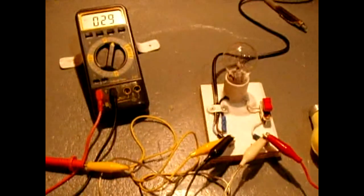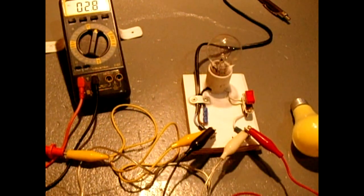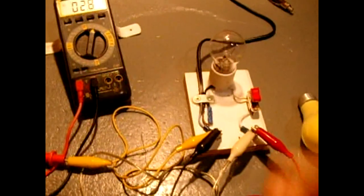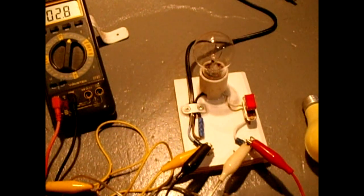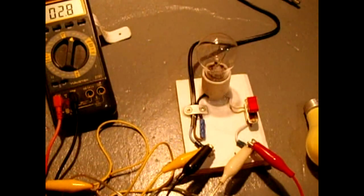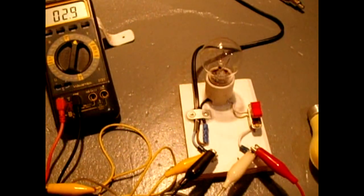As you can see there is a lot of use for this circuit. You could build a power supply and make sure it's properly connected with nothing going to blow by using a load lamp. You can limit the current flowing through the circuit, save yourself damage to components, and save yourself the cost of blowing fuses — which could become costly if you're constantly replacing them.